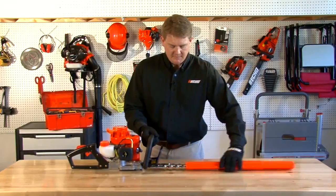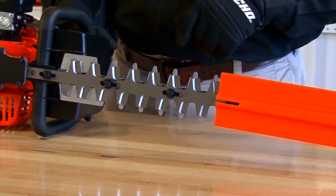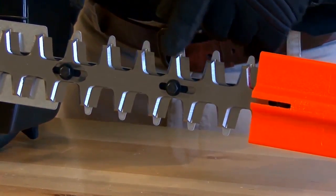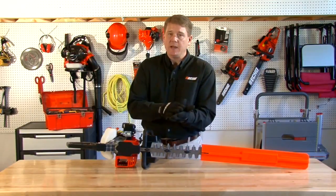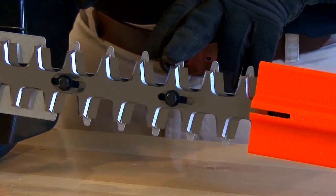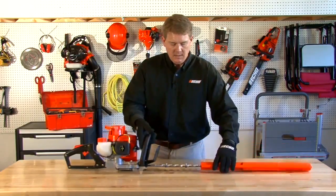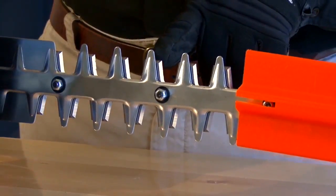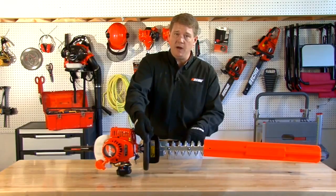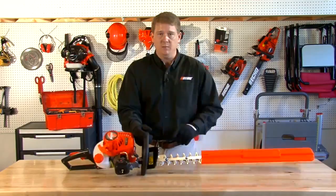Let's talk about the blades. These blades are precision cut and sharpened on three sides — the top and both sides. Since it is a reciprocating blade, both edges will actually cut. The tops are ground so you actually cut the material before you cut it. Another feature to look for is a blade guard about a quarter inch to three-eighths of an inch above the blades — that's going to keep your hands, fingers, and clothing from getting too close to the blades.